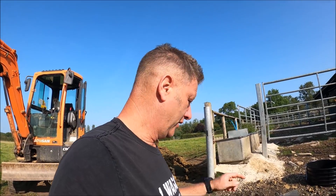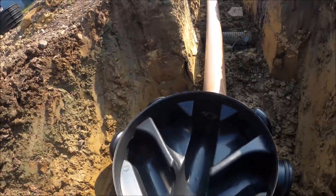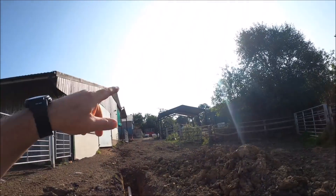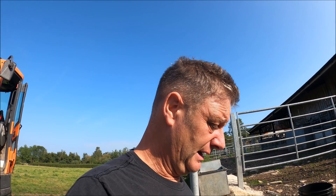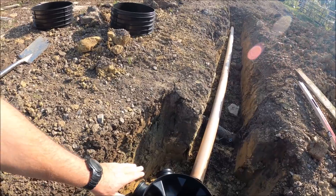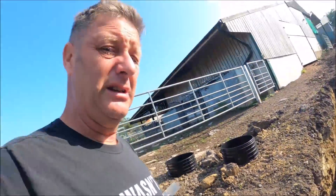I looked at the concrete gullies - to put a concrete gully in here is like £500 and I don't have that. So I think if I can put this gully in here, like that, on down - it's going to be right in the middle of the gateway so pretty much anything heavy is going to go either side of it. This will be left open for a bit because we've got to put two or three more concrete pads in for the barns, so we'll order an extra metre and once it's all set up I can put concrete round this fella. I'll probably backfill up to about here and then concrete round the top, put a solid base underneath him, so if I want to join onto these later on I can. Maybe I'll just shoot some offcut pipes out and go outside the concrete.